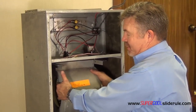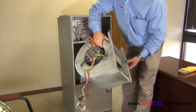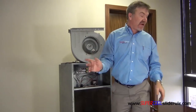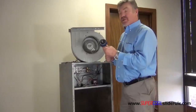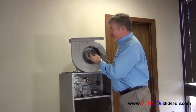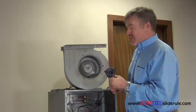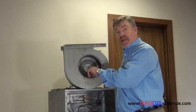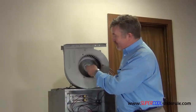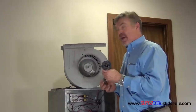I've removed the bolts in the front — it just slides straight towards you. Once you have it out, it's really much easier if you have the correct tools. The correct tool for this is called a hub puller. The way this works is it bolts on right to the front. You have to unscrew your shaft all the way to allow it to go over. Do not put a crescent or any wrench on this motor shaft — if you do, you'll never get it off. We'll loosen our set screw and clamp your puller on there.